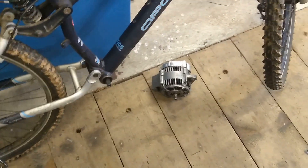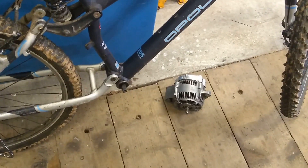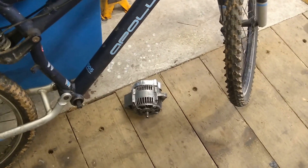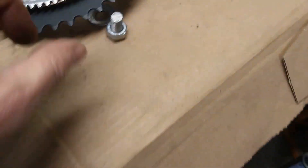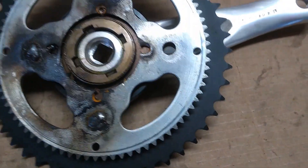That 13 to 80 reduction gives about six, seven, or eight to one — I'm not sure exactly — which hopefully will be enough. The motor will want to spin at two to three thousand RPM, so there's no way I can pedal that fast. Anyway, I'm going to get this last little spud welded up to this sprocket and then we'll see what happens after that.